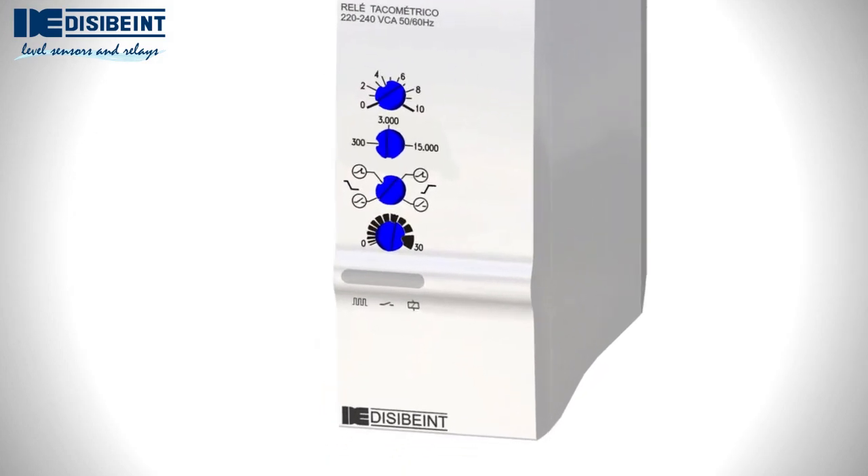To the left of the front is the viewer, which houses the various light indications to know the status of the relay. The green LED indicates the presence of voltage and is lit while the relay has power supply. When the red LED is illuminated, it means that the relay contact is activated. The third LED, when present, can take on different meanings depending on the characteristics of the model — for example, it can indicate a second relay, pulse input, etc. Its color can also vary depending on the type of indication intended.